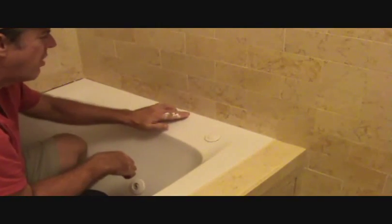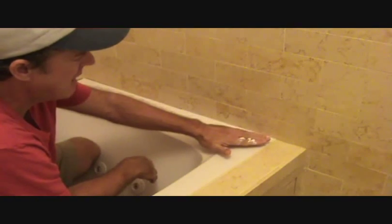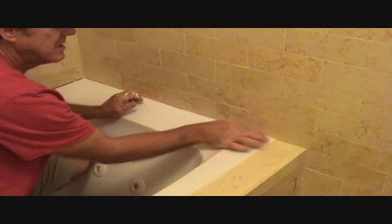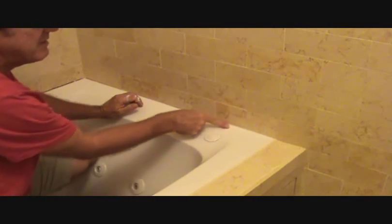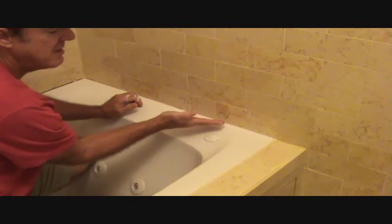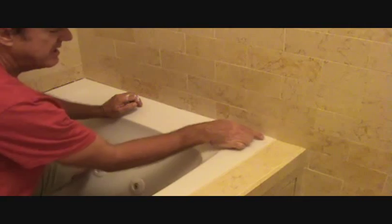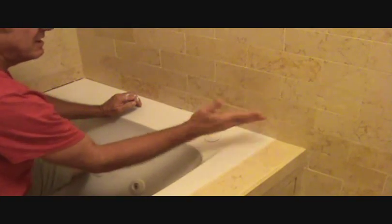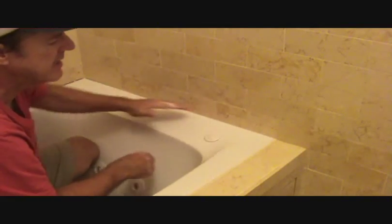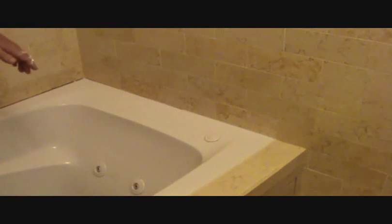That's all I'm going to do for this first go round, so it's going to be nice and even all the way around. When I get ready to put my next bit of caulking on there, I've got to let this dry first. Then I can put a nice thicker bead — not too thick, but not too thin either, it's a happy medium. So then I can put a nice even one on here knowing it's not going to spooge underneath that edge. Because if I put a nice bead on there without doing this first, lots of that caulking is going to push underneath and I'm not going to get a nice even line. It's going to be all crooked — thick here, thin there, up higher there — and it just doesn't look like a professional did it. So step by step, I know you can do this.